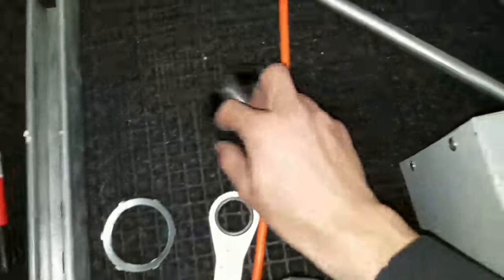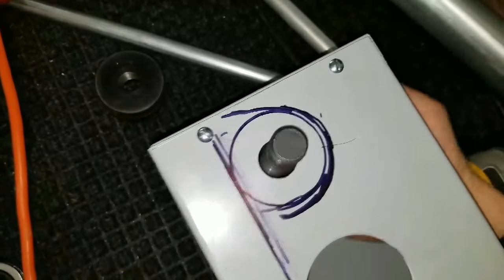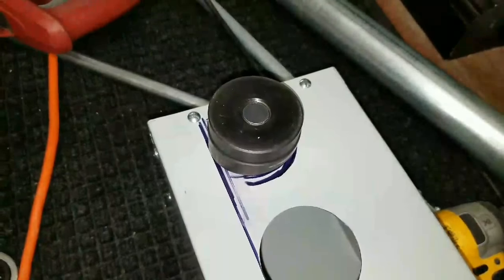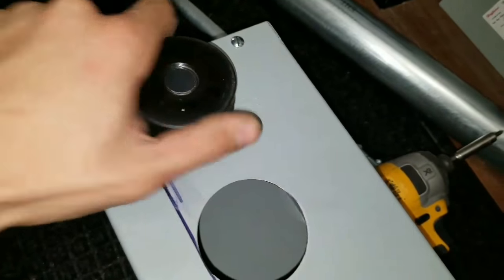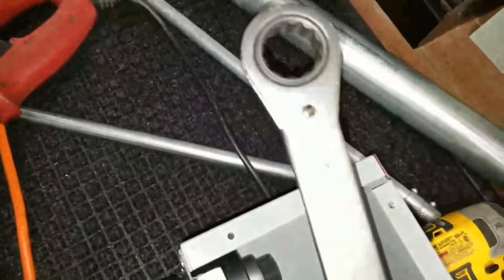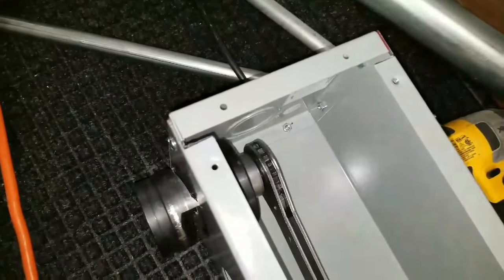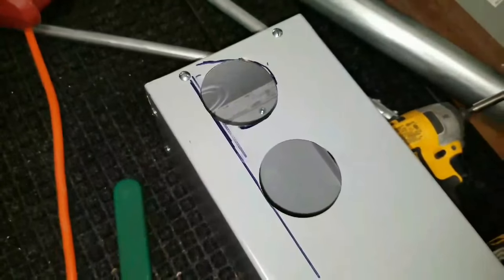And I have this side, the other die. So this is going to come through here like this, and the other piece is going to thread on. Now I've lined my die up where I want to punch it, and it is completely tight. All you have to do is go to the other end. You have this ratcheting tool, and we want the side that says on. That's going to go up, and then we simply ratchet this until it's punched through. Now we have a perfectly knocked out hole ready to go in place.